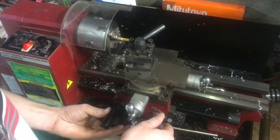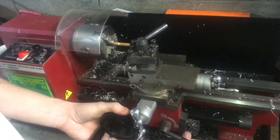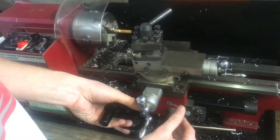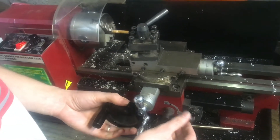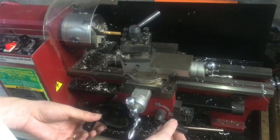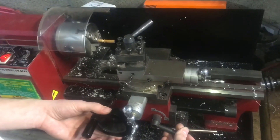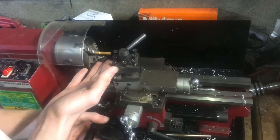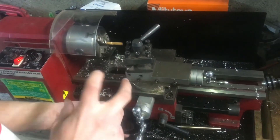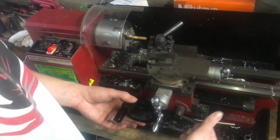It can be pretty tricky because it looks like right here we may have hit the one but we're actually a 16th rotation off, and the same thing over here — we're pretty close to the one but not on there. You've got to be right there if you want to pick up that same thread. In this case we can actually engage the half nut lever before we've touched our workpiece or engaged the spindle, though sometimes you can't depending on what the workpiece looks like.